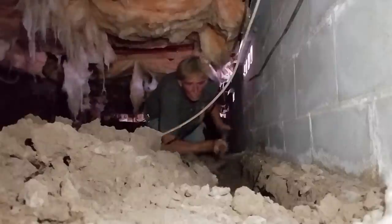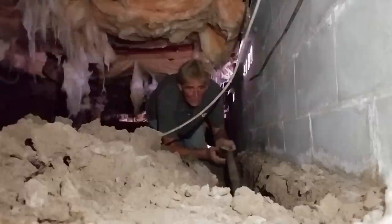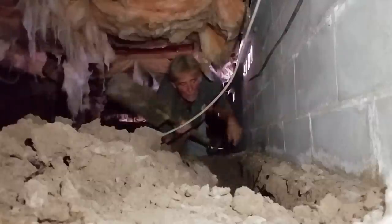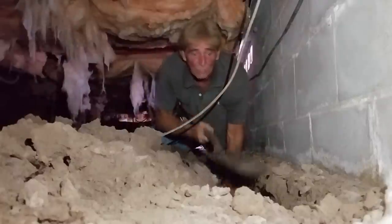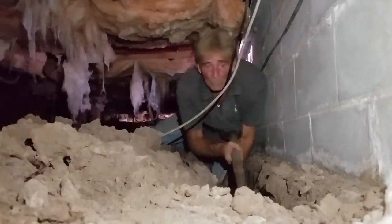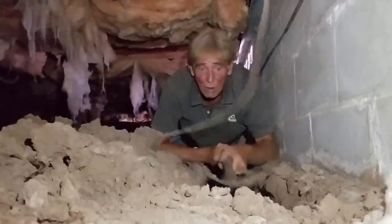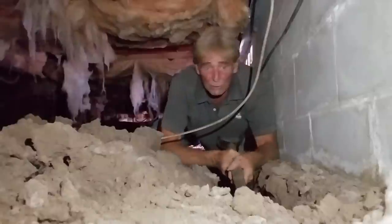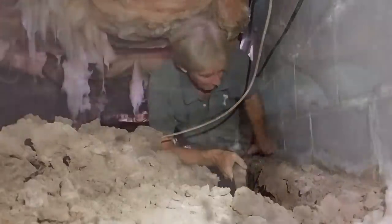And then you just come back through just like you're outside. And you just scrape out the excess. Remember that the footer pipe runs level. And the way the system works, it floods up, and then you have a head of water for it to travel through. It does not have any fall. It follows the footer, and the footer of your house is level.